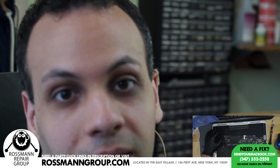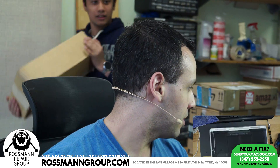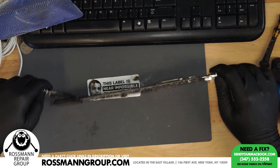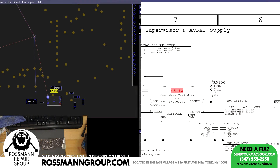I have an overlay — thank you to whoever produced the overlay. If you stop buying at store.rossmangroup.com, HiHi stops being fed. So where were we? It's still taking 15 milliamps and not turning on. What I want to do is see why SMC Reset is being pulled low. We're going to go back to the schematic and board view.